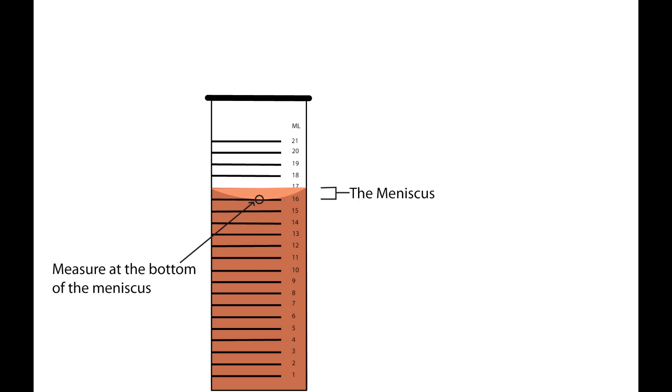When you're measuring chemicals, you always want to measure at the bottom of the meniscus. That meniscus can appear sort of as a double line because you can see the way the chemicals look when you're looking through them — they're a little bit lighter in the meniscus than in the bottom part of the chemical column. The graduated cylinders are actually designed so that they're calibrated to take into account the fact that the meniscus does exist, so the accurate calibration is at the bottom of that curved shape, not the top. As you saw when I showed you the actual chemicals poured into the graduate, there was almost a one milliliter difference between measuring at the bottom and the top of the meniscus.